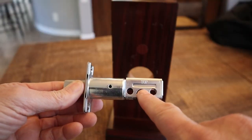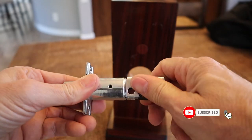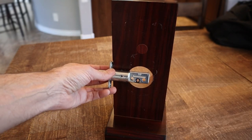Let's take a look at the latch. It does have an indicator on the top — you need to make sure that that is up. The latch will adjust between two and three quarter and two and three eighths depending on your door. So when you install it, just make sure that the spindle is in the center of your hole.